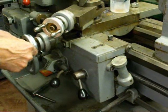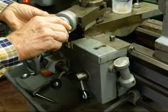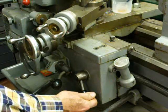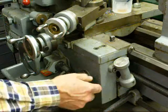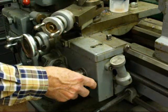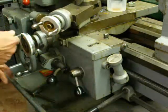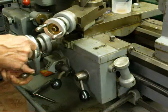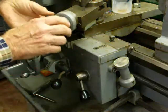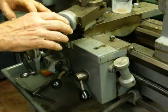There's a lot of repetition here, but that's why I'm going over and over it. Back out the crossfeed, back into zero, advance three or four thousandths, get ready to catch the half nut lever. Engage the half nut lever, then back out the crossfeed, move the carriage back to the starting point, move that into zero, add a few more thousandths to the compound, and our thread is about three-fourths done.